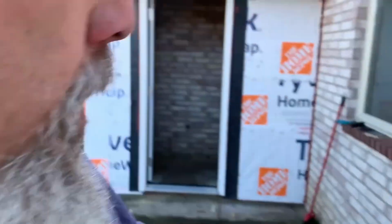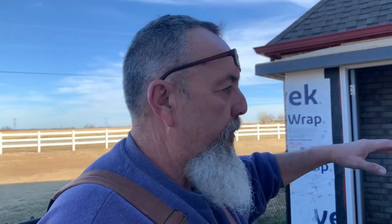And once we get this to a point, then I could finally work on the master / primary bedroom closet, because we've had our clothes out of that closet because of all the issues we've had each winter. Each winter, something happens. Our first one was the condensate drain froze up, so it backed up. And then the pans, because the furnaces up there were set in horizontal positions, and they had shut-off switches. But because the wood platform was all wonky, you step on it, it just wasn't a good installation. The switches never went off, but the pans overflowed and came down inside the master bedroom closet.